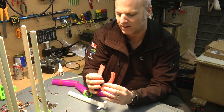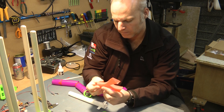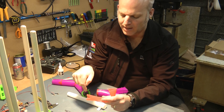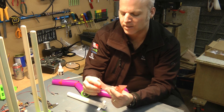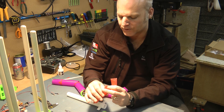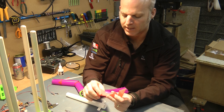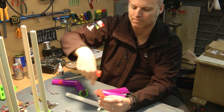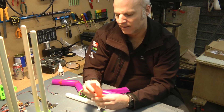These are super, super light — very, very lightweight. Three parts because I wanted to get this to print in a continuous style, where the Z axis on the printer continuously drops. You get a very smooth part with no start-stops. Anyone who's done welding knows what start-stops are — you end up with a horrible zipper that you need to clean and file off. If you do it this way, there's no start-stops. It literally starts at the bottom and the build plate lowers in a continuous Z movement until the end, and you end up with a great-looking part.